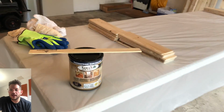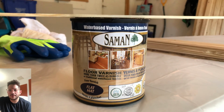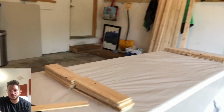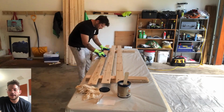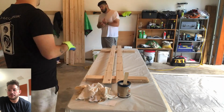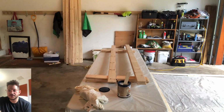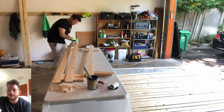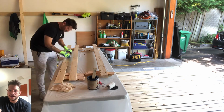So going back and forth with the client, deciding on a color for this rear wall. We were initially going to stain it, but then after doing some test samples, the client decided to keep the wood natural, so we just did a nice satin clear coat on top of the wood. So I got those all coated and dried before I installed them. Just made the installation process easier, and we were able to just get these all cut to size and clear coated and dried before we installed them into the rear wall there. So I'm just going ahead and using my roller, applying that clear coat nice and evenly and allowing them to dry.